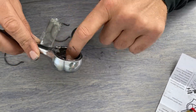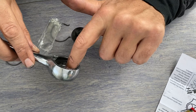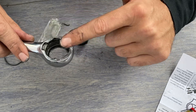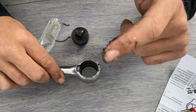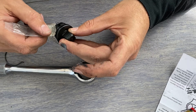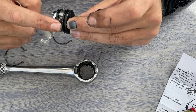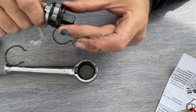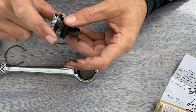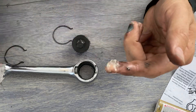100 teeth is pretty darn good because a lot of the half-inch drive products on the market are in that 70-tooth area. There are some extremely high-end products all the way up to 120 teeth — I think Stahlwille makes one, Snap-on might have one also. But 100 teeth is pretty good compared to mid-range products. I'd love to get up to 120 teeth, but to take this classic design up to 100 teeth is just awesome. I'm going to use every bit of this grease.